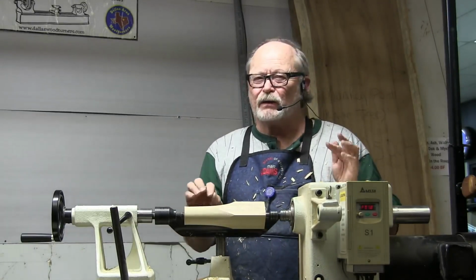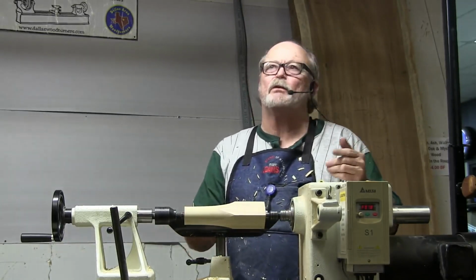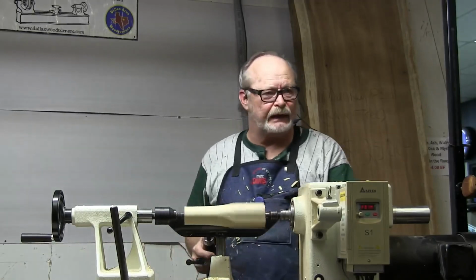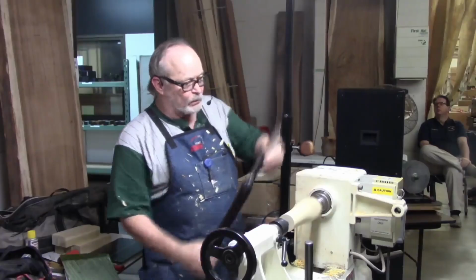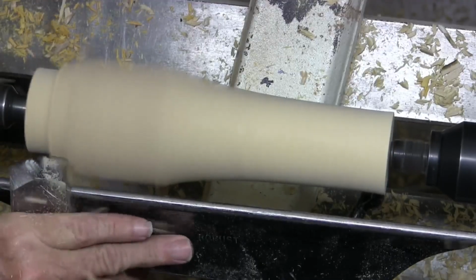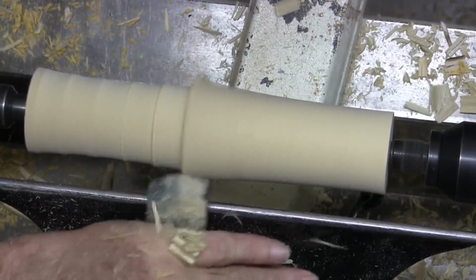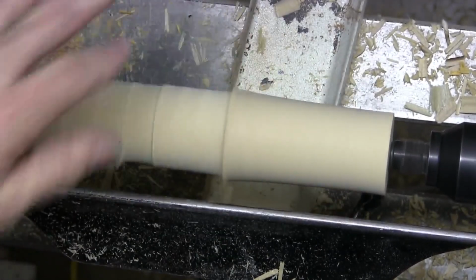So I wouldn't take off the corners using that technique on a figured wood like cocobolo or something, or even red oak is bad about that. So we would take them off by peeling. This is peeling, totally different animal. Handle is way down. I got the tool almost vertical. Hand on top. Now, it's not going to be as nice a surface, but there's zero chip out.